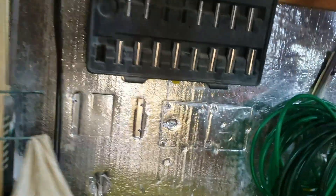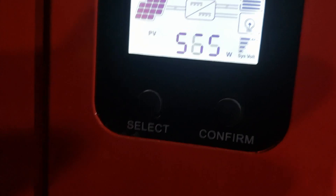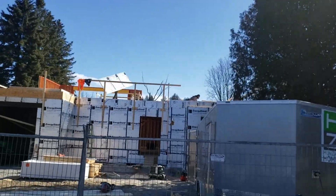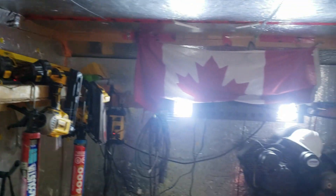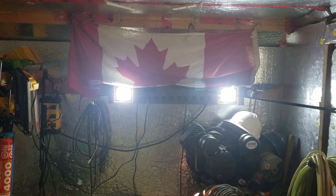But it's a pretty good little inverter. It's not going to run your house — it's not designed to run your house. Multiple large loads will kill it pretty quickly. We are making 570 watts from solar. We're charging the Chevy Volt Generation 1 battery — it's a 12S, about 4 kilowatt hours. I've got 1,030 watts on the roof of this work trailer and it works really well. Hope you guys enjoyed the video. Thanks for watching, see you later.